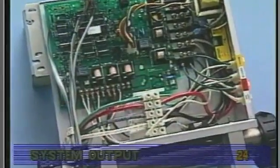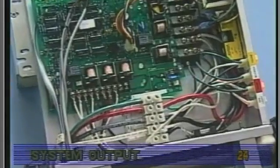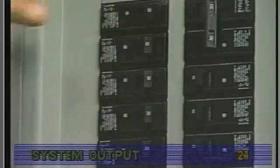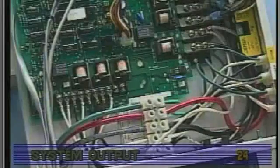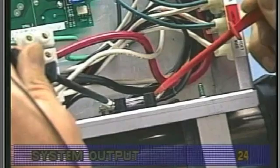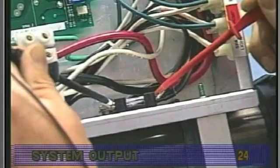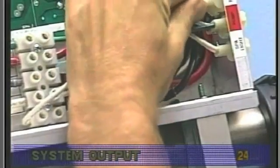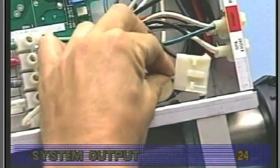On the other hand, if you do have correct voltage at the circuit board, turn off the system power and check for a blown in-line fuse. Blowing the in-line fuse or the power input fuse is usually a symptom of a faulty pump or blower, or shorted wiring to one of these devices. If the fuse is good, or not used in your configuration, then replace the output connector.